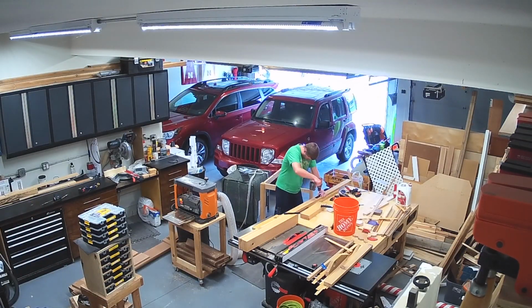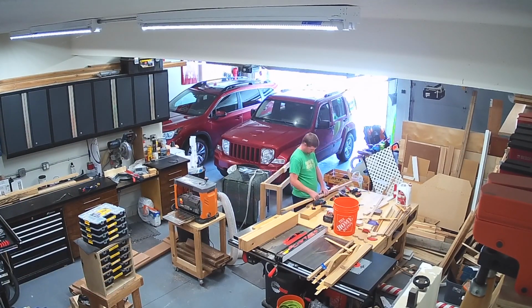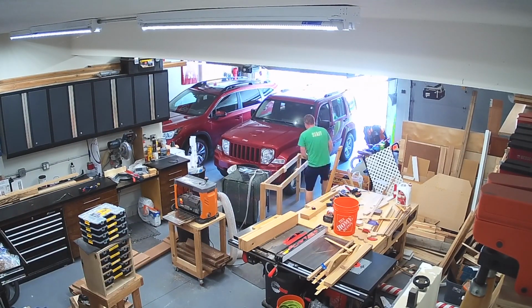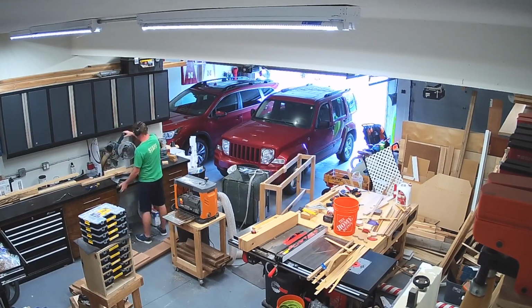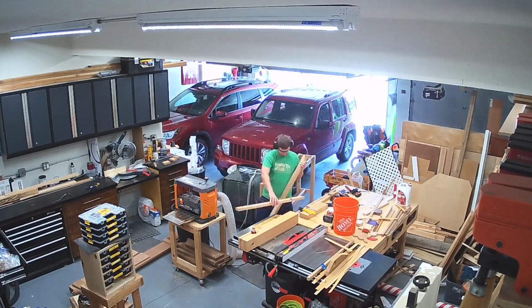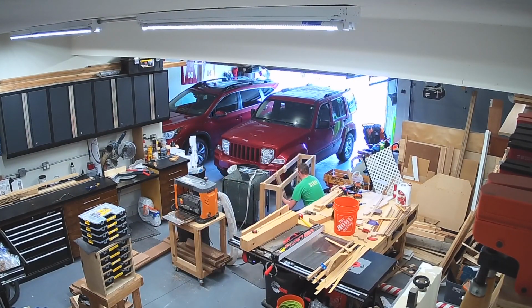With the legs and top stretchers dry assembled, I could get some real measurements for the bottom parts. For the bottom stretcher that would be more visible, I joined 2 halves with some dowels and bolted on some 3D printed brackets. These brackets are as much about looks as they were about structure. This long stretcher then attaches with some dowels to the leg assemblies.